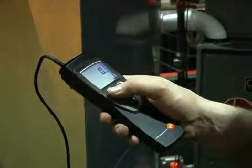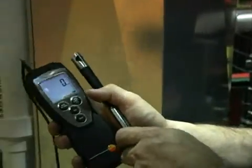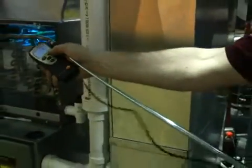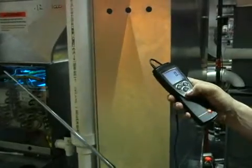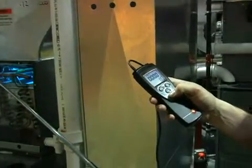You don't need to reset it, and it's going to come up to the feet per minute. Now you just extend the probe out full length. And you're going to use the mean button on the bottom, and toggle through until you see the timer, which is where it's at now.